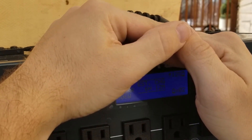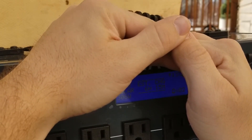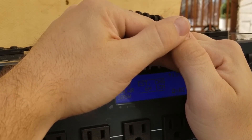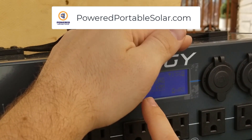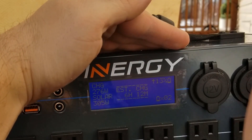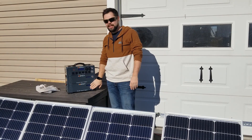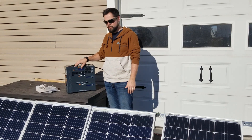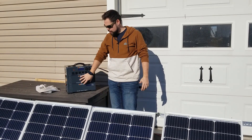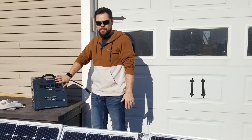Each one of these panels makes about 20 volts, so with four in series we're at 80 volts. You never want to put more voltage on a solar generator than what the charge controller is rated for — that's the easiest way to ruin your charge controller and cause potential hazards. We're getting about 300 watts total, meaning each panel puts in about 75 watts each in series, which is less than the 85 watts they each produced individually. With 300 watts of solar input and each battery being 1,000 watt hours, each battery will take just over three hours to charge.